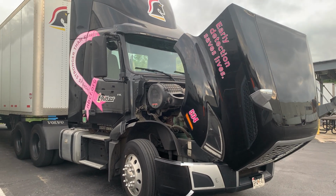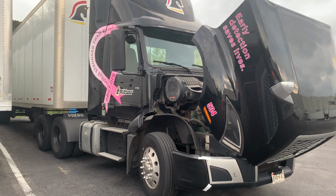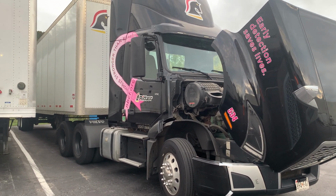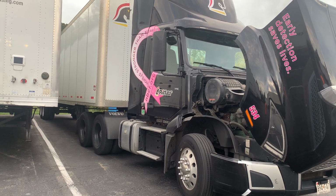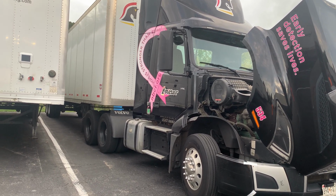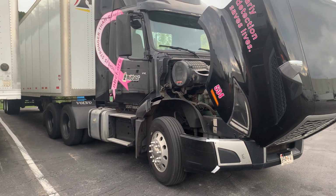Vehicle pre-trip inspection of the outside of the tractor and the trailer using the vehicle inspection checkoff list. Lenses. All lights are security mounted, not cracked, clean, and proper color. Amber for the turn signal, clearance and ID lights, and clear on the headlights.